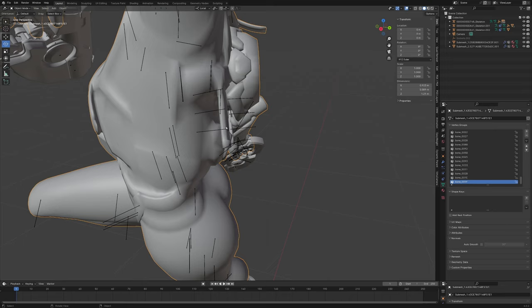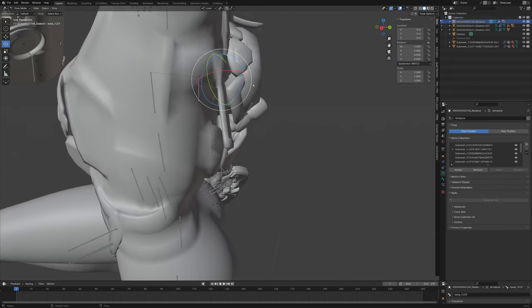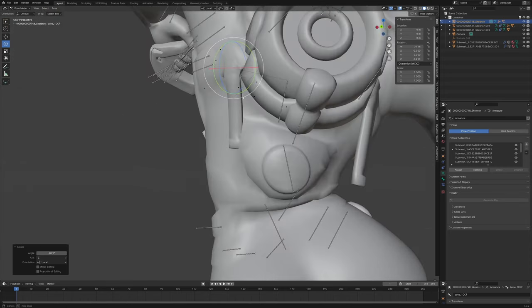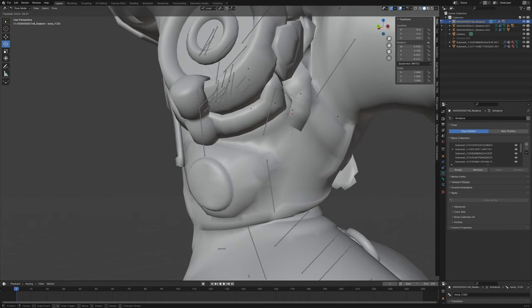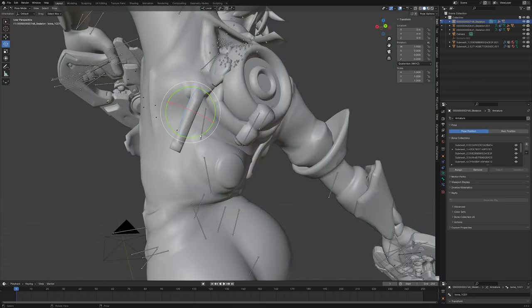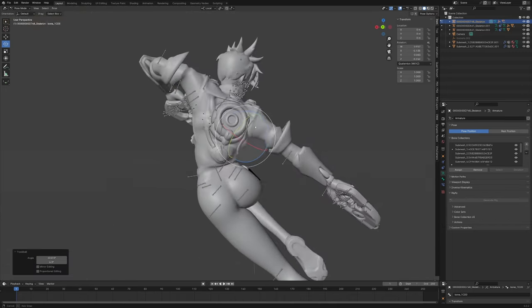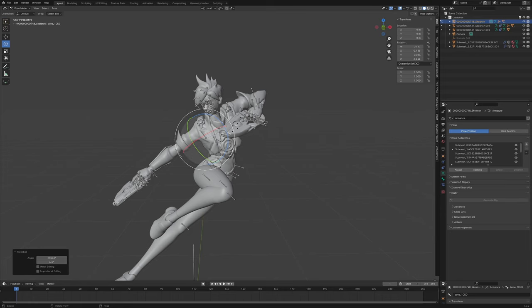Yeah, and also things like these, little things poking out, you might want to put those close near the body, like this maybe, just intentionally make it so that it looks like it's supposed to be pressed up to the body to get the minimal amount of supporting needed. At least that's my advice. Just like that. Now, if you have a resin printer, that's less of a problem. But I have an FDM printer and that's still not gonna be good.